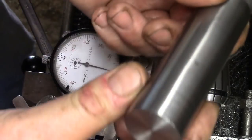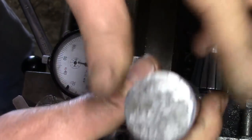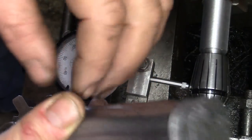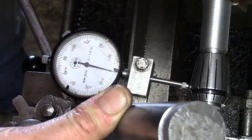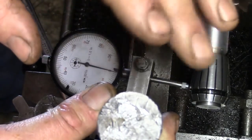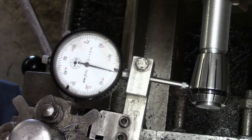Little lead knocker I made out of a piece of tube. Made a cap to go in the end. Just squashed the cap in the vise. I've got a couple of blow lamps, obviously, with being a plumber. I just put a blow lamp either side, just kept dropping lead in until it filled it. Some old lead pipe I took out of a house a long time ago. And then when it was full, scraped the crap off the top and just messed about it till it was full. Put it back into the lathe and just machined that bit off the end. Quite a handy little thing, actually.